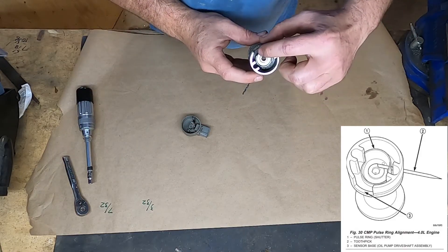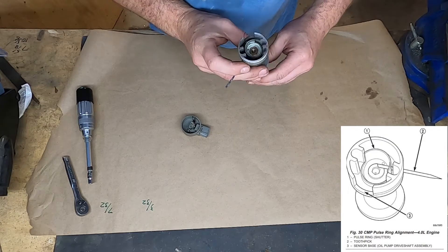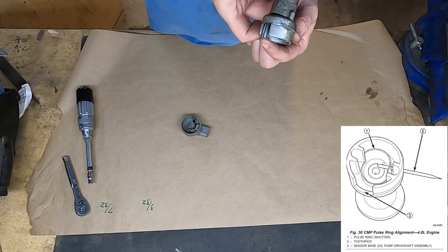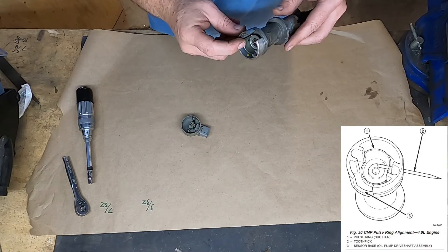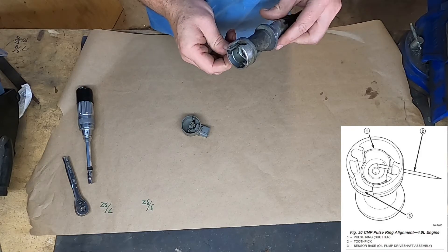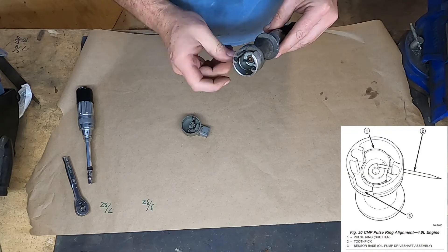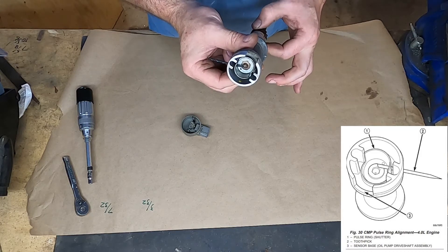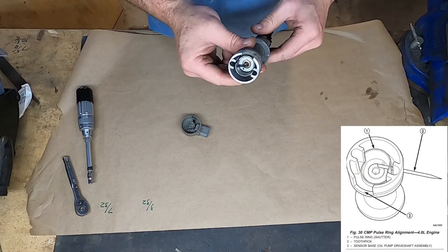You then need to look at this window and find a corresponding little hole. Look inside and you'll see the corresponding hole — you slide this drill bit through this aperture and lock it out. No matter what I do now, it is locked using this 3/32" drill bit.